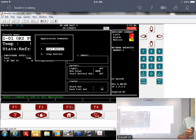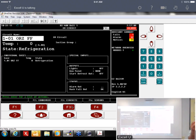In the case that you had, Eric, where the fan wouldn't come on, what I would have done first was look and see if it was being called for. It was. The little fan was on the display. The fan was on the display, but the fans weren't running, and the relay wasn't engaged. So that's why I just checked all the connections, and when he said it came back up.